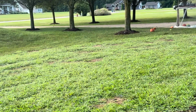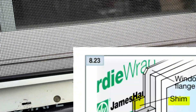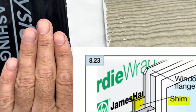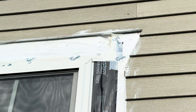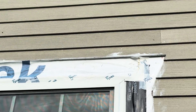The other thing noticed: you need to put shims around the windows. There's about a quarter-inch gap there, which tilts the board back instead of being flush with the wall. Without Z-flashing, the top board tilts back and water runs down the siding and then backwards into the Tyvek. The Z-flashing will fix the water issue, but aesthetically these should be boxed perfectly — you can see little bump-outs because the right side of the trim is on the edge and the left side is on the OSB.